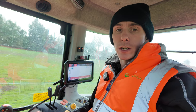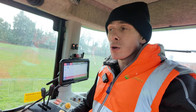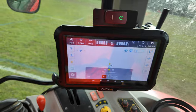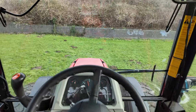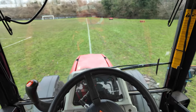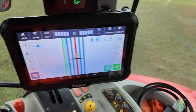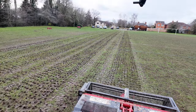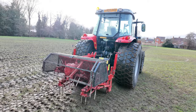I'm over at the football pitch that we are vertidraining today. Just got the one here but it's still going to take a while - loading up the GPS and we'll get cracking. This is our first time at this site with the GPS; we've been here before but not with the GPS, so we're just plotting the boundary so the GPS knows the limitations of this pitch. Once we've done that I can set my A-B line, set the centre of the tractor up with the sideline, click A, drive down it, hit B at the other end - this gives a datum point for the tractor. This site is mega boggy, it definitely needs vertidraining.